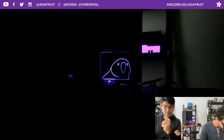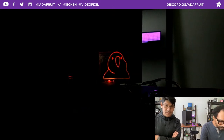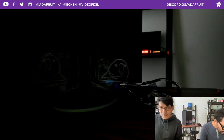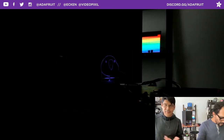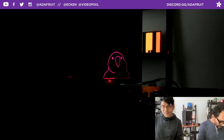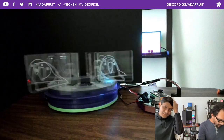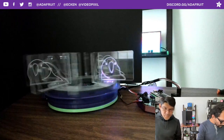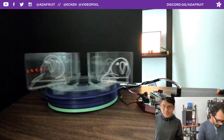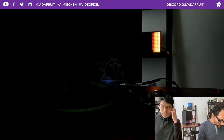That's how it's able to change the colors using the photo interrupter to advance the colors — it steps through a rainbow. It's very difficult to see with the lighting and reflections from the windows, but the effect looks really great in person. The party parrot is 10 frames; each frame has been etched on a piece of acrylic which can be laser cut or CNC milled. It's a cool way to show a zoetrope with edge-lit acrylic.